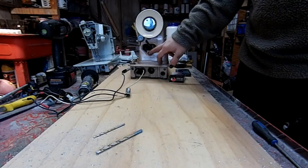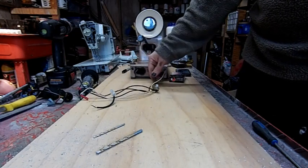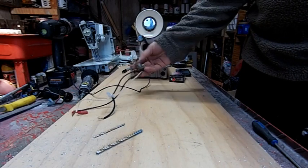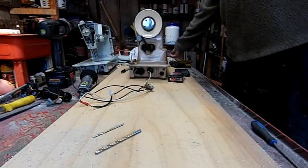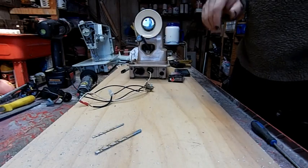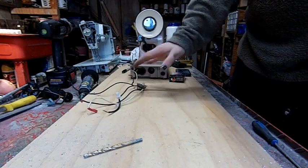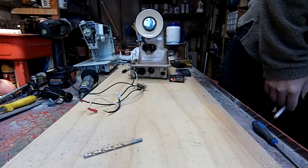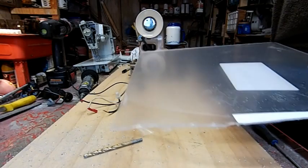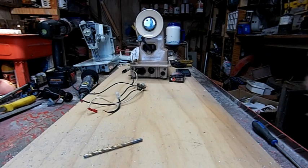Now the next step we've got to do is figure out how we're going to mount our switch. These are our two wires from our light, which we're going to be soldering to the switch and the main power in off the plug. Here's our switch itself, so we're going to need that for the sizing. Remember that plastic plate I told you not to throw away? That gives you our size for the square hole that we're going to need. You could use plexiglass, plywood, hardwood, whatever you'd like to use. I don't recommend metal — worst case scenario, you've got some vibration and one of these wires rubs through. Use something that's an insulator. I could use clear plexiglass, but clear plastic on a machine of this caliber — it's a vintage machine, to me it wouldn't look right.